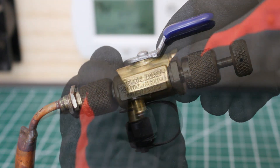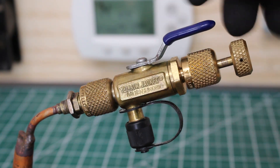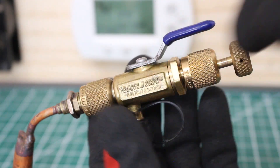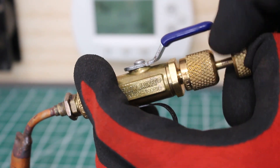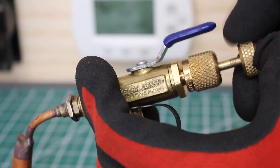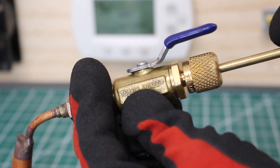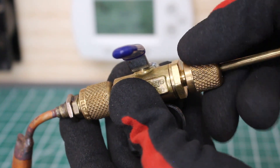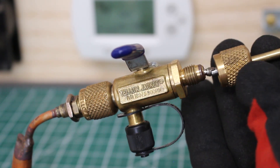You only want to hand-tighten this. Now that we have the tool attached, this valve is going to be open — it is parallel to the tool itself. What we're going to do is push this piece forward, because we want to extend it in here so we can reach the Schrader valve itself. As you push, you're going to unscrew. Let's see if we can actually get that valve — I think I got it. Now I'm going to pull this back and close the valve because we don't want any refrigerant escaping.